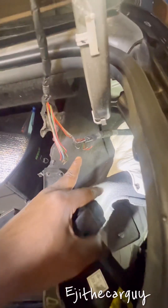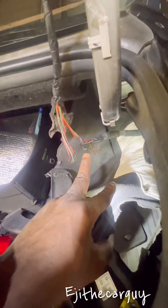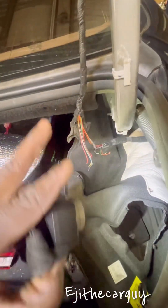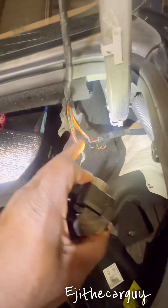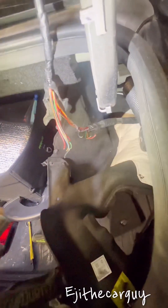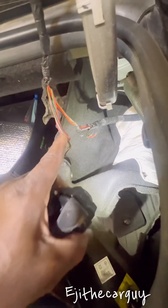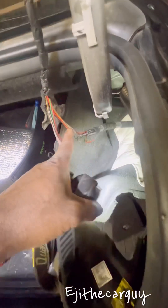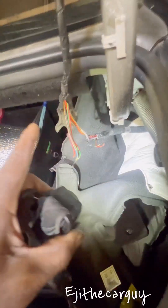What I'm going to do is get another wire and make it a little bit longer — just an inch or a foot — so it has room. I believe this happened from opening and closing the trunk so many times over the years. They didn't give it enough room, and the wire quality isn't as good as it should be. So I'm going to put an extension on all of them so this doesn't happen again.